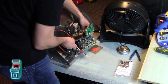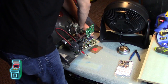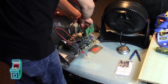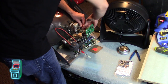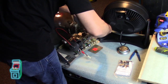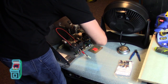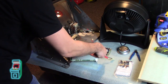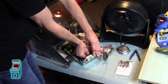The things that are connected - you have the degaussing coil, which I'm about to take out here. They're sometimes a little tough. I also built a little connector here for the ground wire. Typically you'd cut it and put it back together after, or desolder it from the neckboard, but I built a little connector that is pretty sturdy. That way I can connect it later. It's easier to take the whole thing out like this so you can get a good grip on the other wire.